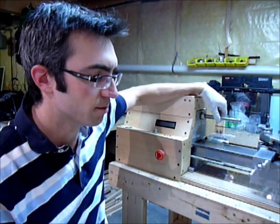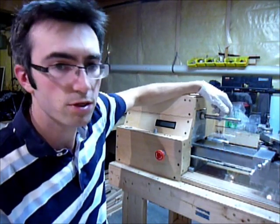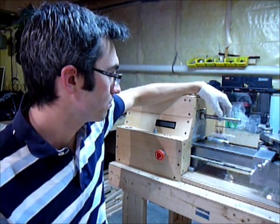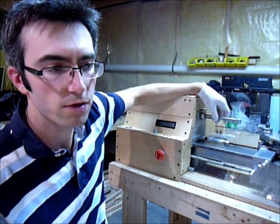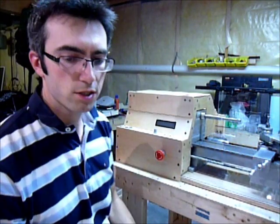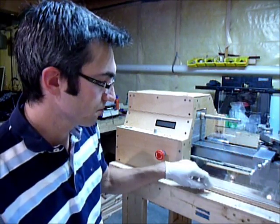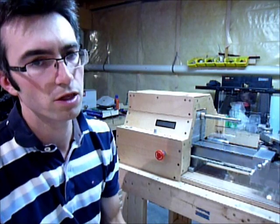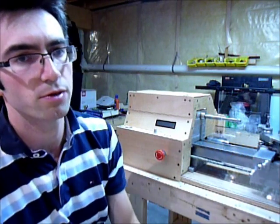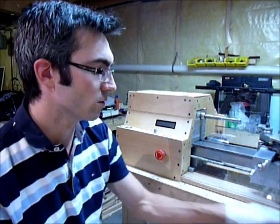After this I'll do a little demo. I have a shaft collar — a set screw collar — that I'll put on here and turn down. It's some type of steel. I'll take a light cut with the automatic feed lead screw drive. I also updated a lot of the software. I can actually get the RPM really low, like 5 RPM, but it cuts pretty good at around 30 with light cuts in steel. This thing cuts really well in aluminum too.